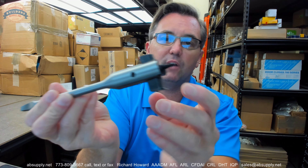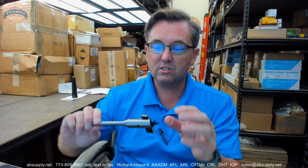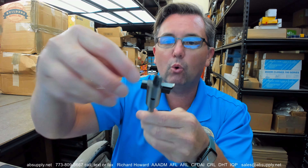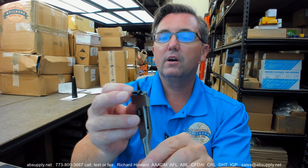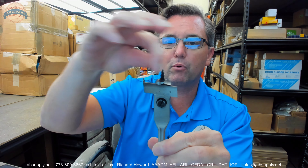Overall length is about 8 and 3 quarter inches. Again, that's a self-centering bit. Once you get that started — and that's probably why you're going to use a brace — self-centering bits have a tendency to get started really fast before you're ready for it. Then it'll core that out and score around; you're going to have your cutting edge lifting the material out of the center and scoring it around the perimeter. That's how you work all that material out.